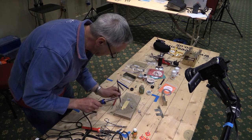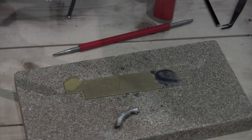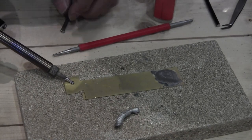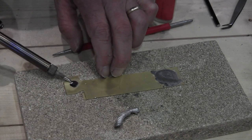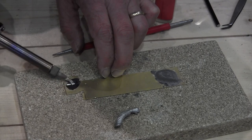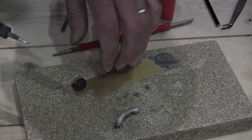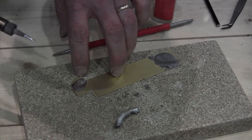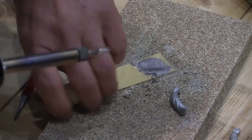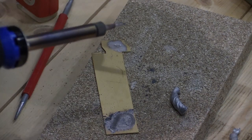So back on our piece of spare brass, this is Red Label flux. And some white metal. Now, sod's law, isn't it? This is actually tinning okay. But before, the received wisdom is that you don't really rely on 70 degree solder to tin the brass. Okay, so this bit that we did earlier is actually going to give us a much stronger joint for our white metal.